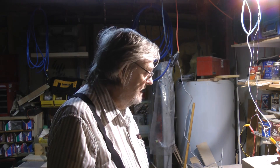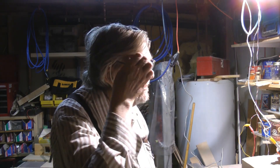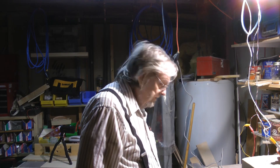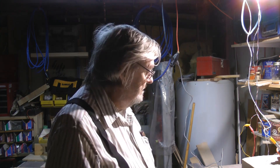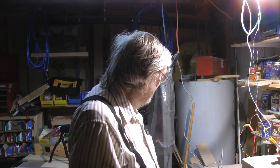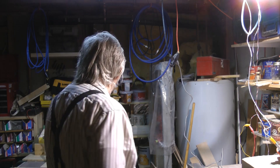I wanted to talk a bit about LEDs and power, heat sinks, and temperature. When you're putting power into an LED and it's going into the heat sink, one of the most difficult things to calculate is what temperature it's going to stop at. I'm probably not up to doing that kind of math, but what I can do is set up an LED with a certain amount of wattage going into it and simply wait a couple hours to see how hot it gets. Measure the ambient, write it all down.